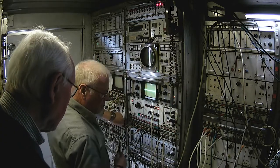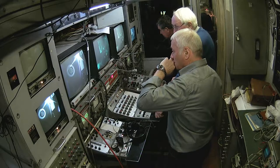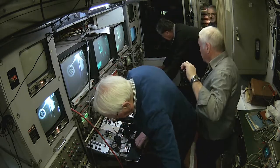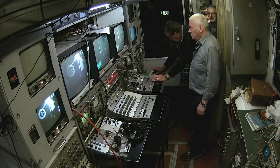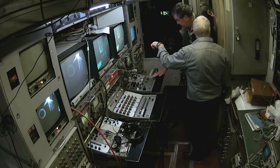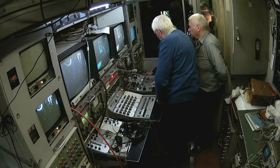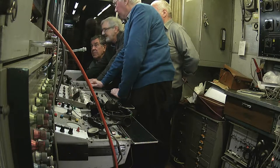Yeah. Well, actually, we could put a muser in, a U-link in, just for now. Yeah. Okay. It's gone away again now. Yeah, it's to do with this overloading something. Or to move the camera off that. But yeah. I've got all three outputs there on the monitoring. So we know red, green and blue are a reasonable level. So it's coding. But looking at the monitor RGB, we're not seeing... No, I know. Picture. Yeah. Makes the streaking come and go. Getting better. Still, well, still not blue. I've pulled green down, you see. Yeah. Oh, that's green fully down and blue fully up. Right, and we're still not. I suppose we're making some headway. It's presentable, just about.